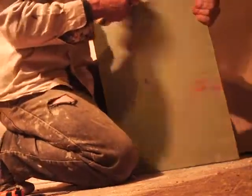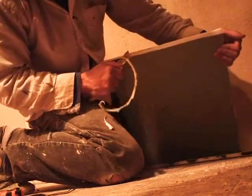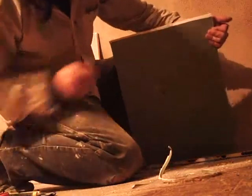Now something really special and very important to know: it is to make a channel for plastering. Many people don't know this. You cut in 5mm to get this channel, because this area is going to be plastered after. If on one side you already have a factory channel, you don't have to cut it. But on the other side, you cut in a channel for plastering. Of course, you don't cut a channel when the board goes against a wall — only when it goes between plasterboards at a joint for plastering.